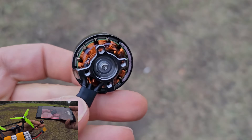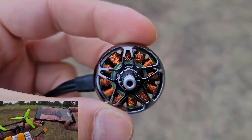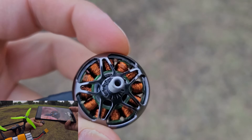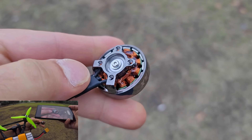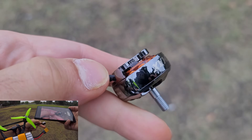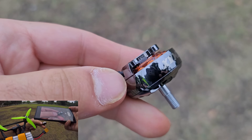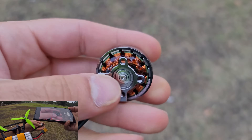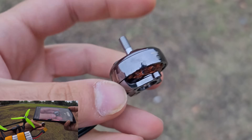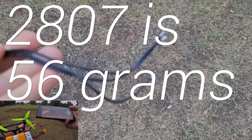The motor has multi-stranded windings, which are more cost effective. They don't perform differently — arguably better to some people and worse to others — but they look messier and are a little more cost effective to deal with. It also has a resin coating underneath the stator, which is really nice because it protects the stator from screws you might jab it with during mounting. It also holds the wires on tight so that if you break an arm and rip a motor wire, it doesn't pull out of the base of the motor as easily.